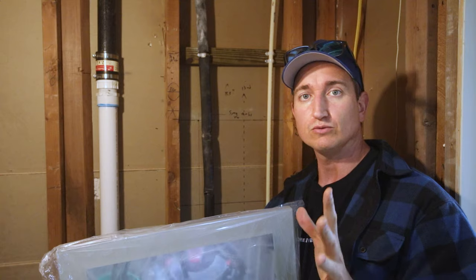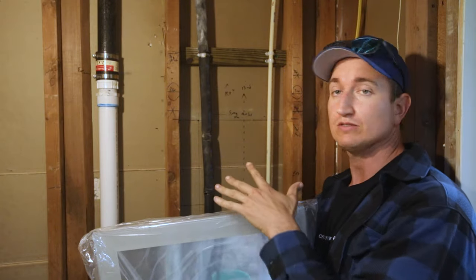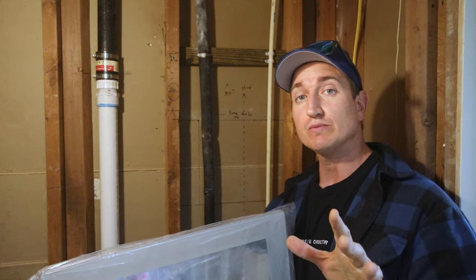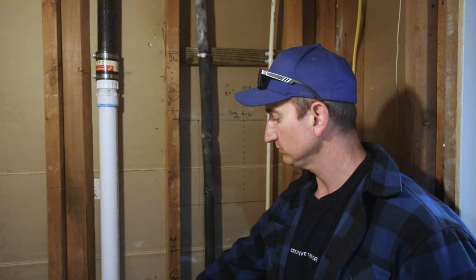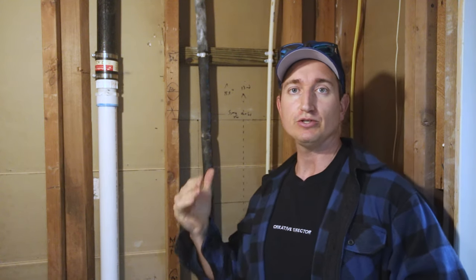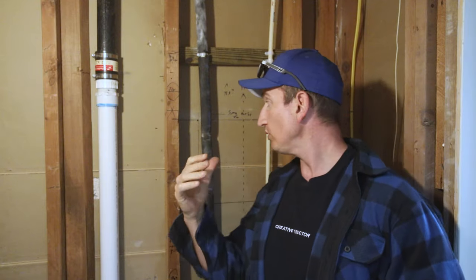There are a few caveats to getting this right. You've got to find out where you want the mirror, and that's going to depend on vanity size. I'm assuming I'm going to use a 25-inch width vanity. You want to know pretty exactly where you want the mirror to sit before you figure out the power situation. Since I'm down to the studs, I'm going to figure out where I need to put the outlet so it can fit behind the mirror and be hidden.